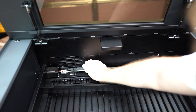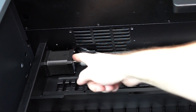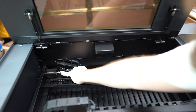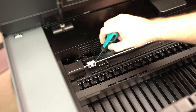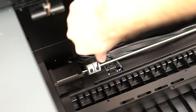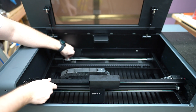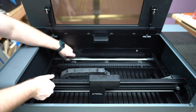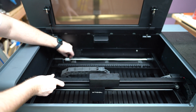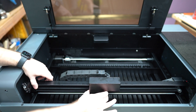Over here is the coupler — this piece holds the gantry to the motor. As you see, when this moves, so does the coupler. So we're going to undo these screws here. They're in there tight. With these screws undone, you can observe the gantry is now flexible — it'll move left to right and up and down without the shaft rotating. So that allows us to get an angle on this.